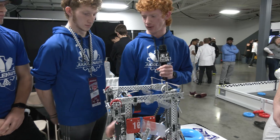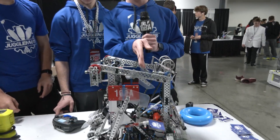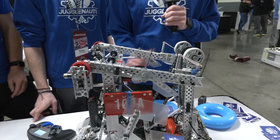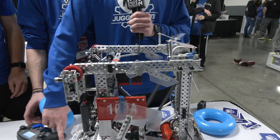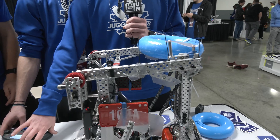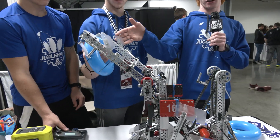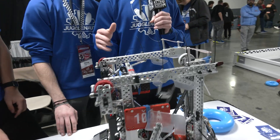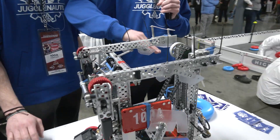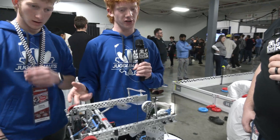It's a simple Lady Brown mech with three stages. It can start down and score under a MOGO, then we have a second stage right here that loads the ring. And then our last stage goes up onto there. In our program we're able to just set different states so we don't have to move it up and down and set it to the perfect spot, which helps us do that really fast.